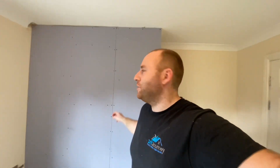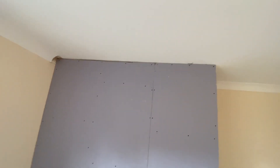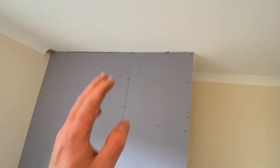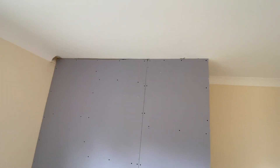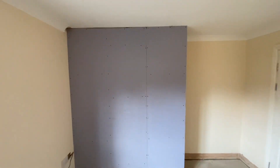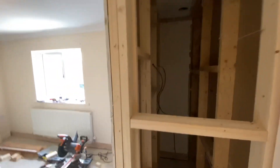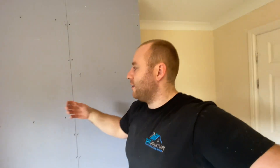And there we have it — plasterboard's on. These are mega heavy so I'd suggest two people lift them because it's near on impossible to do a neat job on your own. Hence the cutting at the top which leaves something to be desired — a lesson learnt. This one cut a lot better but I kind of chopped and hacked at that first one unfortunately. However, I'm not too concerned — coving is going on there. I've not done the end yet as I want to get this video out. I've still got a bit of wiring to do and I've run out of cable clips.